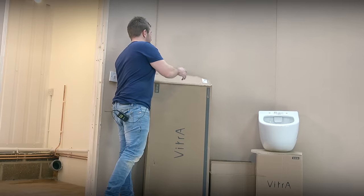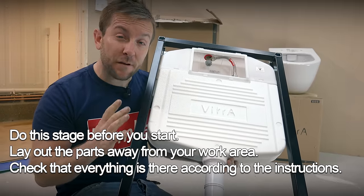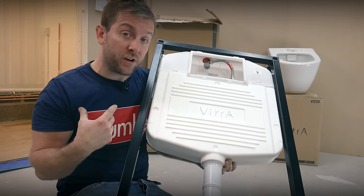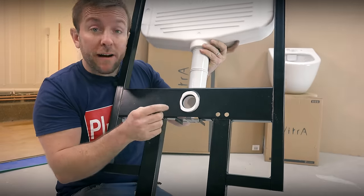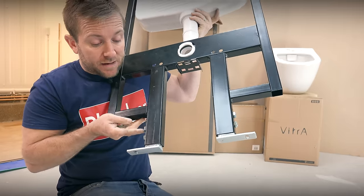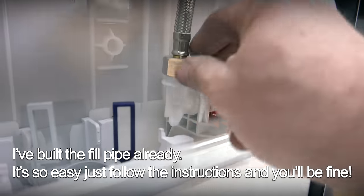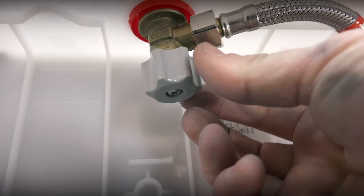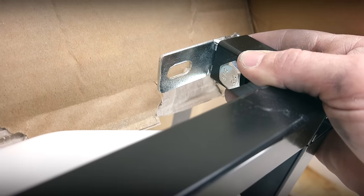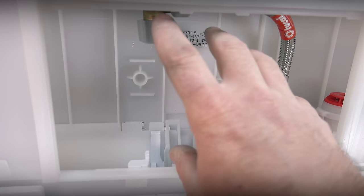Let's have a quick look at what we've got in our box. This is the main piece of equipment — the actual Vitra toilet frame. These are very, very simple. We've got our cistern with polystyrene around it to stop condensation, because you're going to be pouring cold water into a warm environment. We've got our flush pipe integrated into the frame, a big gap for our four-inch waste, and bottom adjustable feet with two nuts that adjust each way. Integrated inside, we've got our fill valve, a flexible connector going up to the shut-off valve with a standard half-inch male thread. At the back, we've got spaces set out for how far we want to set the toilet away from the wall, plus the flush control arrangement for the second-fix side.